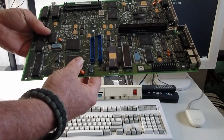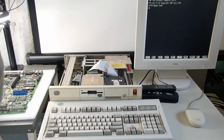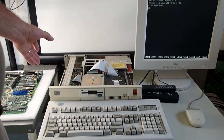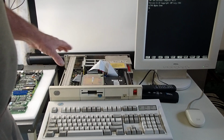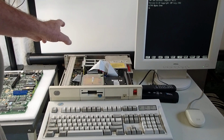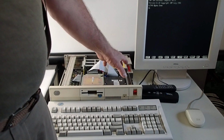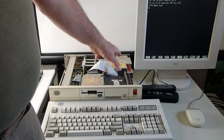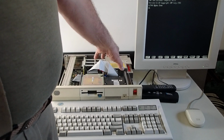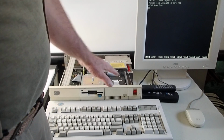And on my unit, I actually have what's called the Greenock planar, and that's just based on that it was produced in Greenock, Scotland, and they changed around some of the components, but these units have a later BIOS and other nice features for running the 30 megabyte hard drive of the unit. The earlier Model 30 units with their BIOS are only able to run the 20 megabyte hard drives, if they even had one at all. There were dual diskette models as well.